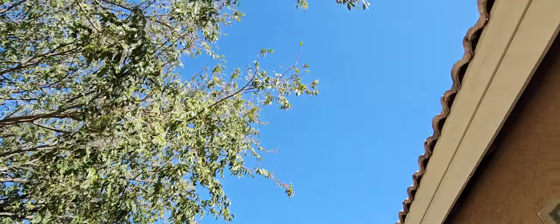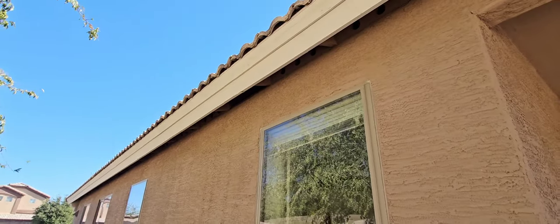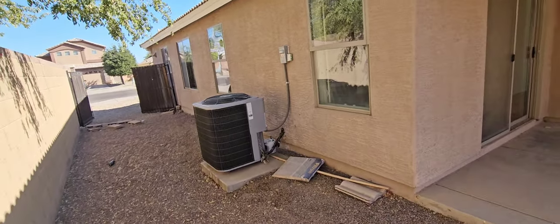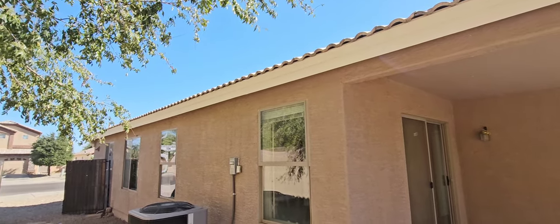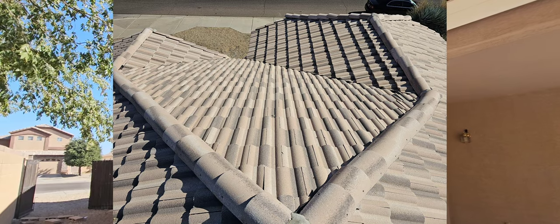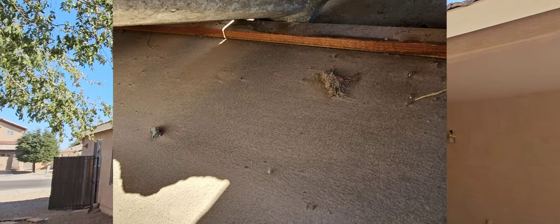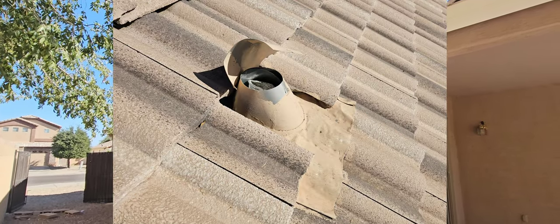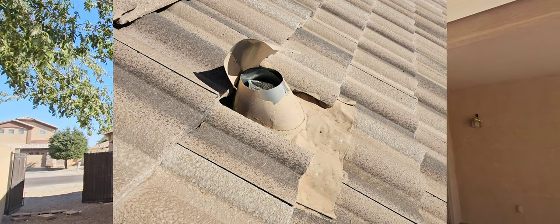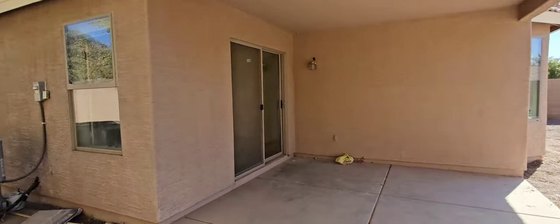Eaves here — we've got a little bit of overhang from this tree, not bad. Just keep your eye out for any branches that are going to be rubbing. I think the underlayment on the roof is original at 20 years. We've got a couple tiles pushed out of the way — concrete tiles — which is exposing the underlayment. The underlayment is the waterproofing barrier and at 20 years you're almost at its life expectancy. Get those tiles replaced and get a roofing company to give you an estimate on re-underlayment. You can call it a re-roof, but the concrete tiles get reused at least once.